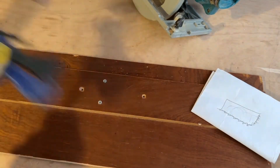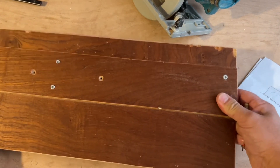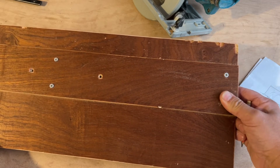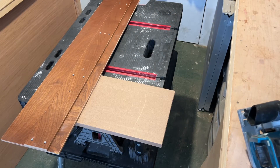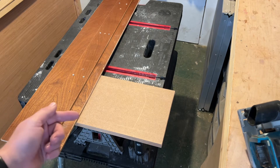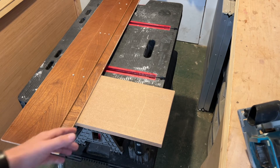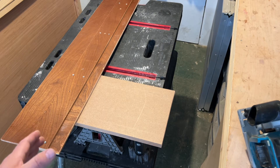Apart from that I have some clamps as well if I'm cutting boards. Let me set this up and I'll show you in a bit more detail how it works. So I've just set this up - it's on a smaller scale, I haven't got much room, but let's say this is the bit of board you want to cut. If you are cutting ply or MDF, you don't have to cut from the bottom side, but the opposite side to the machine will always cut a bit neater. This edge being flush does stop a little bit of chipping as well.